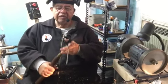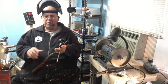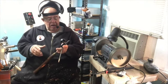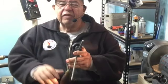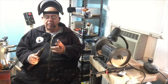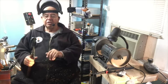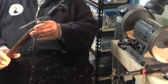I said Ellsworth-Avisera grind — David Ellsworth is one of the leaders of the woodturning world. Eli Avisera is a turner from Israel whose living is made turning and teaching. Eli showed me that relieving the bevel helps me do a barbell or a very fine finial without tearing it up. He showed it to me one night at a demonstration at Arrowmont. I came back and have never used an Ellsworth-type grind without relieving it — never. A pro told me it works. I slide the jig in, put it to the point, no adjustments, and my tool is ready to go.